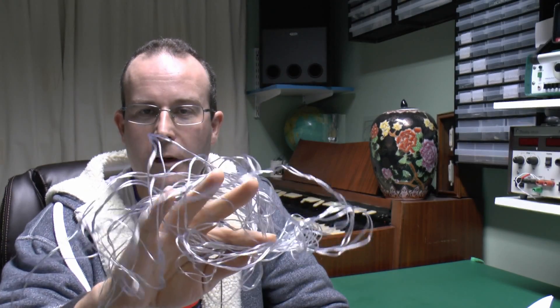Now if you actually took this wire and connected it directly across the mains, then twisted the two ends at the far end of 9 metres together like we've done here, the fuse is not actually going to blow because you've got 15 ohms plus at about 230 volts — the current in that situation would actually be about 15 amps. On a 16-amp circuit, 15 amps means nothing's going to happen. The result is you'd actually have around 3.5 kilowatts being dissipated in these wires until they either melted, caught fire, or some other failure occurred. A 16-amp fuse could supply 15 amps indefinitely, and even on a 13-amp UK circuit, 15 amps is not going to cause that to fail either.